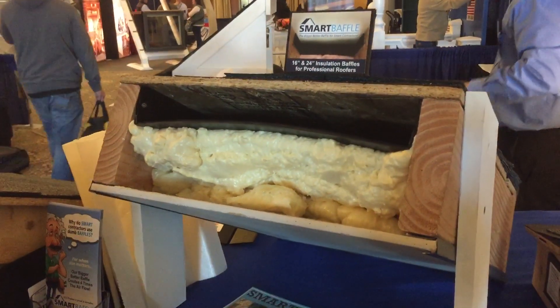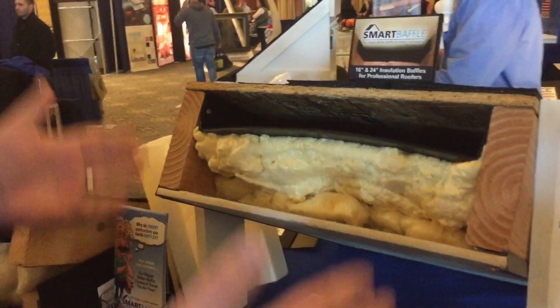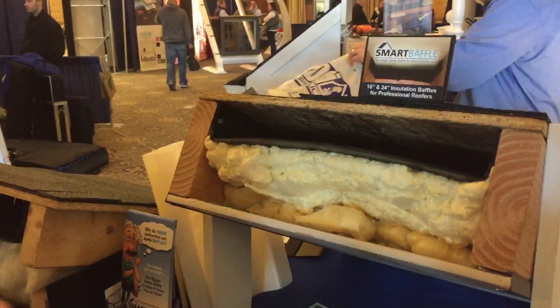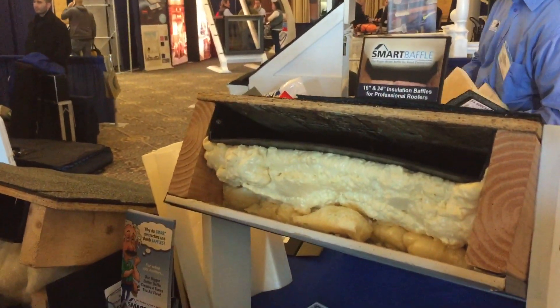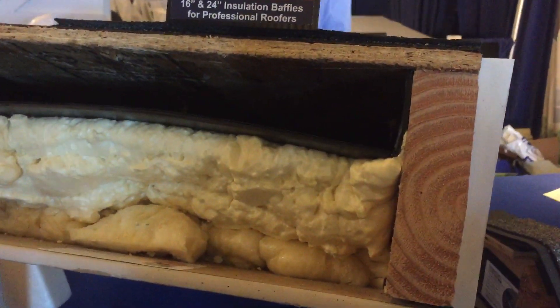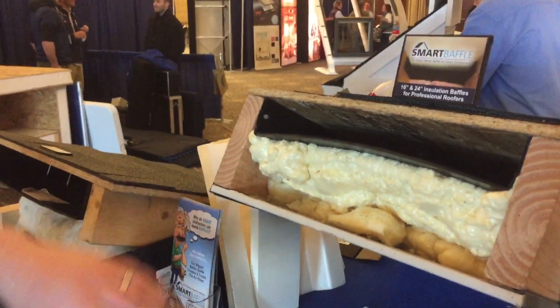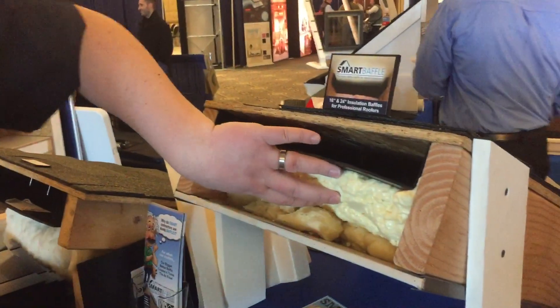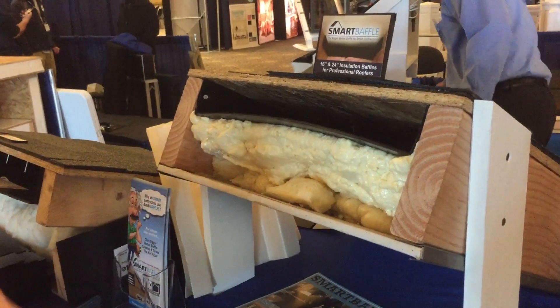Another thing that factors in is your ease of installation. You're able to come across a rafter bay that isn't exactly on-center. You can take a razor knife and easily score the product and make your own bend, so you can make your own size baffle on the job if need be. It's a corrugated polyethylene plastic. It's also got a treatment called a corona treatment, and what that does is it allows the spray foam to stick to it — it's not going to be sliding off. Once it's sprayed, it's going to stick right to it, and you're maintaining your ventilated space and getting the benefits of the insulation as well.